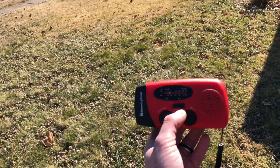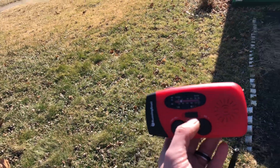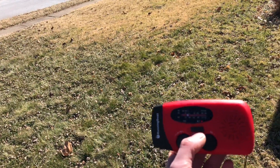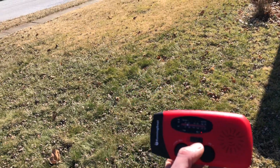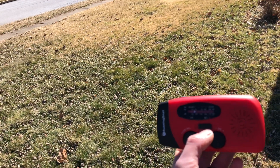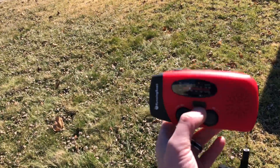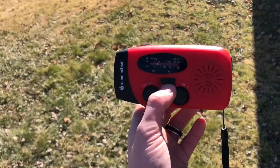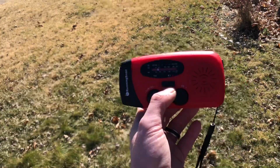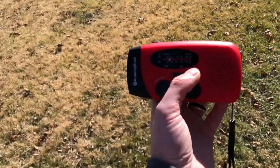I hope you enjoy walking around your house or your front yard with a little AM radio and seeing what the neighbors think — but you'll find that RF and see what's generating the noise. Another way to do it is shutting the power off in the house and turning breakers on slowly, or unplugging everything and plugging it back in, testing it on your radio. This is Mike Cricket 113 — hope that was informative. It's easy to do and a good way to find RF. 73, have a good one, keep playing radio!